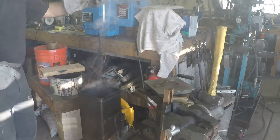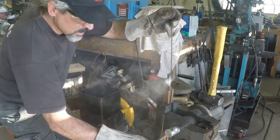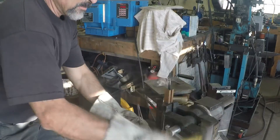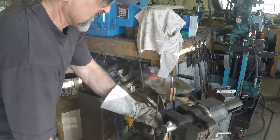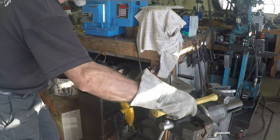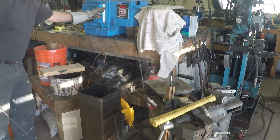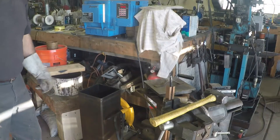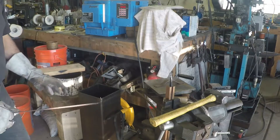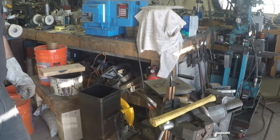Take it out, put it in the vise — on the side, on the spine. Tighten it up. That copper bar will complete the quench and straighten that sucker out. Temperature has dropped back down to about 1,455 — there are two more knives in there. I'm going to leave that in the vise for a couple of minutes to let it finish the quench and keep it straight.